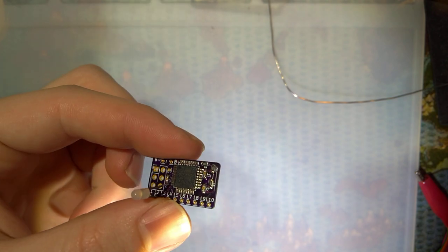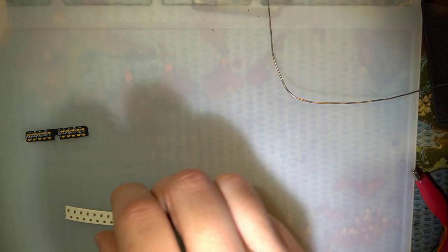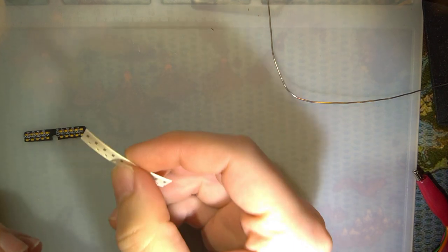Alright, so I got this board nice and cleaned up, got all the flux cleaned up, got it flashed. Oh boy, was that a pain in the butt, because apparently AVRDude doesn't support AT Tiny, whatever. I don't really want to get into it. There is a patch that you can use, and if you are using a USB ASP, make sure you're using the libUSB Win32 driver, and not whatever the default driver that comes up in Zadig is. Anyway, sorry, I'll post a little bit in the description on that, but if you run into troubles, I can't really help you out.